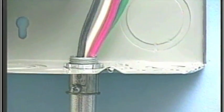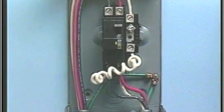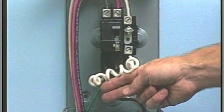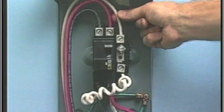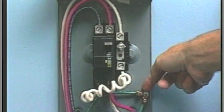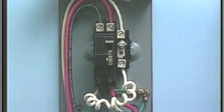All four of these wires will exit the house breaker box via conduit routed to the GFCI breaker box. From the box, locate these four wires. Confirm that black is connected to GFCI line in one and red connected to line in two. The white neutral wire connects to the neutral bar. The green ground wire should be connected and grounded securely to the GFCI chassis. The white pigtail should also be connected to the GFCI neutral bar.